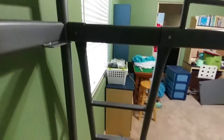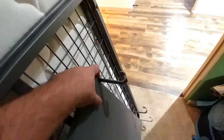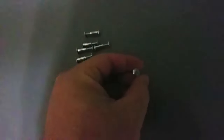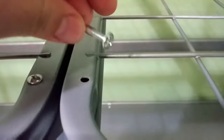The thing on the bottom of the ladder — you lift it up, slide it underneath, and stick it in there so that it doesn't slip out. There are two screws holding the ladder in place. Make sure you put the ladder on before you put the panel in here or you won't be able to unscrew it. Take these three hangers off before you put the desk in. There are other hangers you can keep on there, and the desk is basically filled in by that and these hangers. You'll need these two things and these screws, using a screwdriver for both.